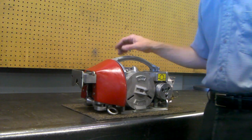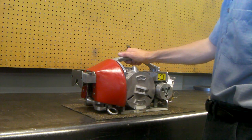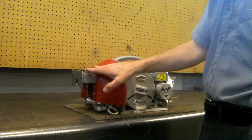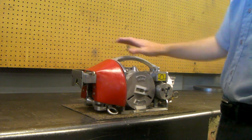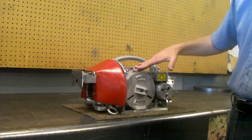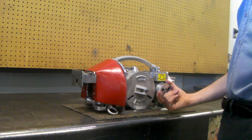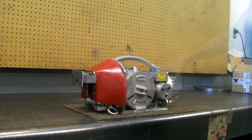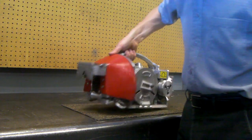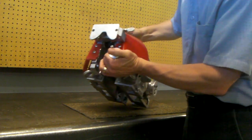Lashing wire is not necessarily included. The Eagle cable lasher from DCD Design is the lightest cable lasher on the market, weighing in at about 24 pounds empty. It has a typical front strand lock, a shroud for passage through tree branches, drop-down doors for the wire compartments, and positive drive wheels for taking tension off of the lashing wire. It also has an adjustable rear gate. The cable lasher is capable of handling bundles up to two and a quarter inches, or a single cable about two inches in diameter.